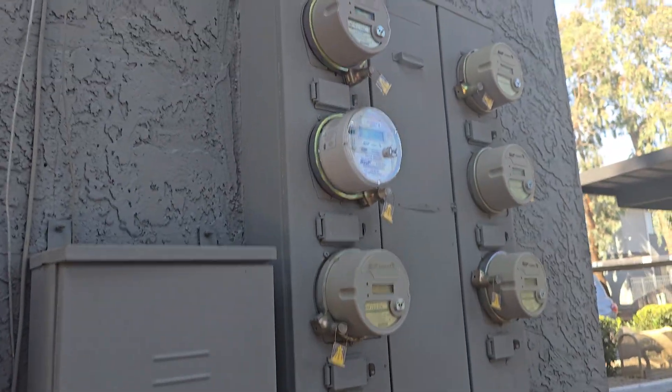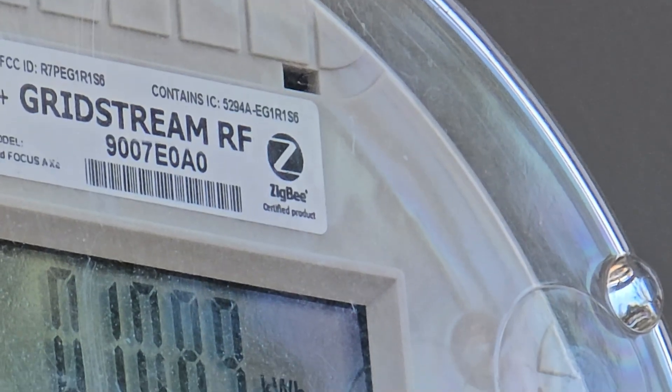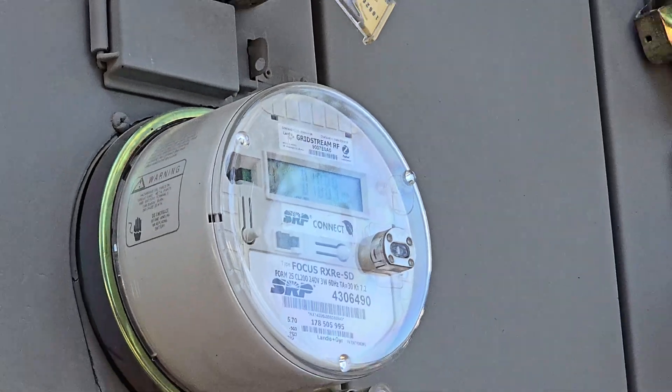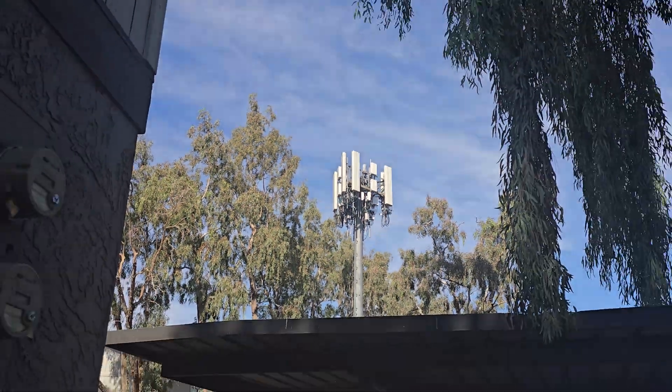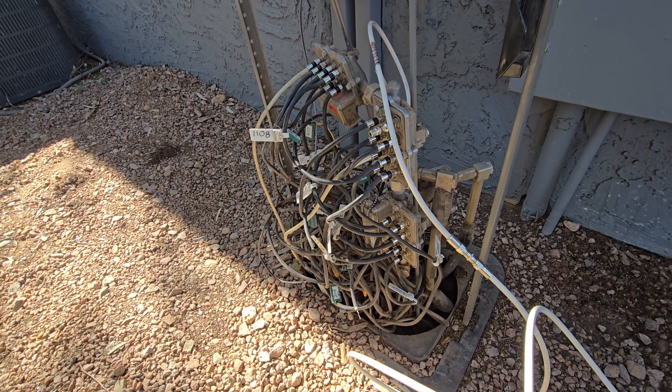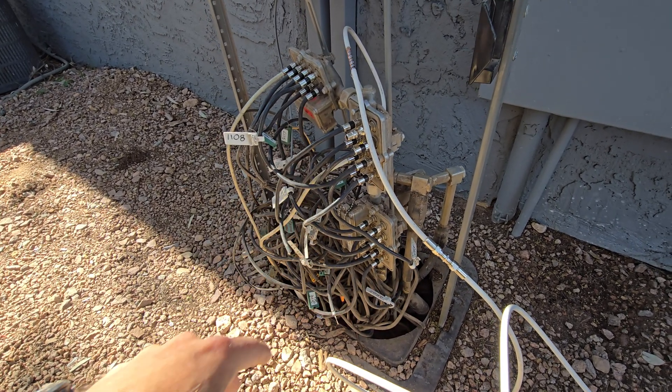As you can see here, we have a power meter that runs on Zigbee. Zigbee runs from 902 to 928 megahertz. We also have a cell tower. Both of those operate in the 700 to 900 megahertz area. And if there's any leaks in your cable plant, it will get in.